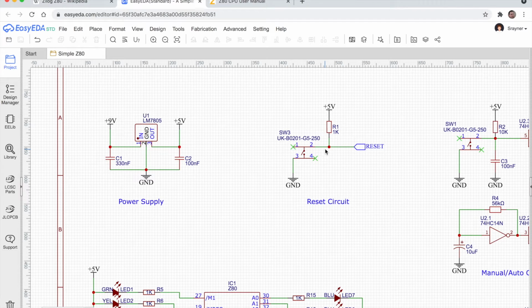I will always talk about conventional current. I'm not going to keep repeating that. So current will be flowing, therefore there will be a voltage drop across the resistor, and we'll actually have 0 volts here. It's pretty obvious we'll have 0 volts because this will be directly connected to ground. So that'll be 0 volts when it's closed.